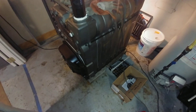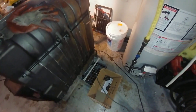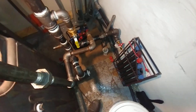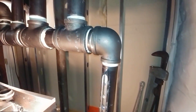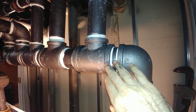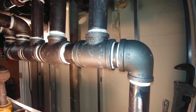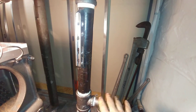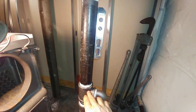I'm back to give you a little progress report on this boiler. Let's go behind and get a shot of all the craziness going on back here. Last time we had a three-inch header where the water returning from the system can get back to the boiler, and it also ties into what is known as an equalizer line, which helps control the water line and keeps the water from getting backed out of the boiler while it's operating under pressure.